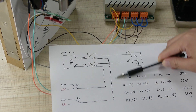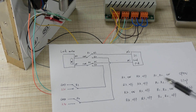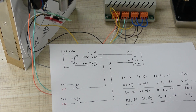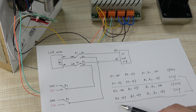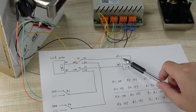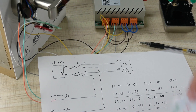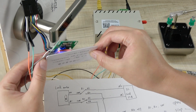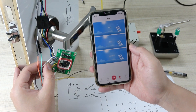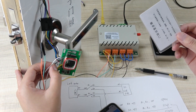When using the mobile phone application, turning relay 1 and relay 2 on switches to the relay output. The stop command is the same: run this command and the motor stops, returning control to the IC card PCB. So after using the mobile phone application, you can also use the IC card to open and close the door — you can use both the mobile phone and the IC card at the same time.